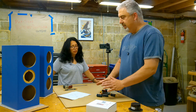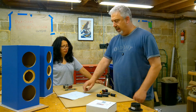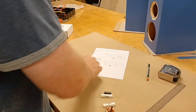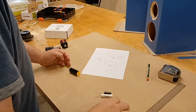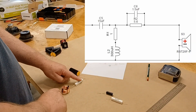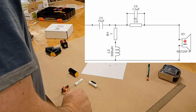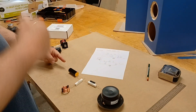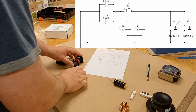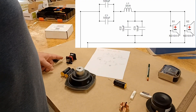Let's take the pieces and try to piece them together to see what we're actually looking at here. We're not about to show you the process of laying the entire crossover out in real time, but what we're trying to do is go over the schematic and lay the physical pieces out in such a way that it mimics the schematic drawing — doing the tweeter first, then the woofer section next. Doing them separately helps keep things organized.